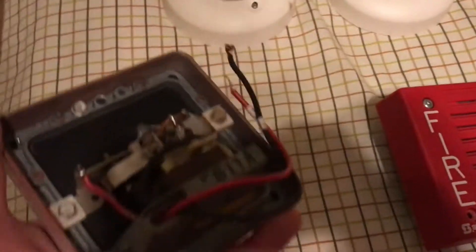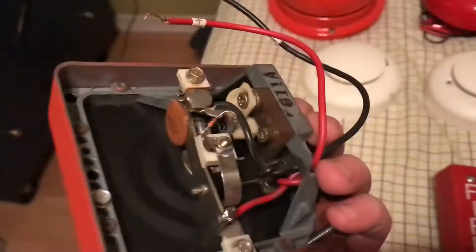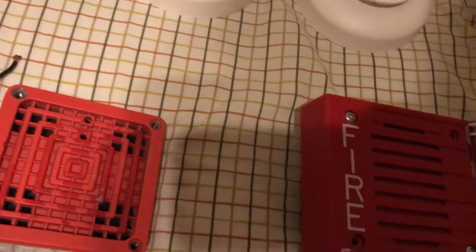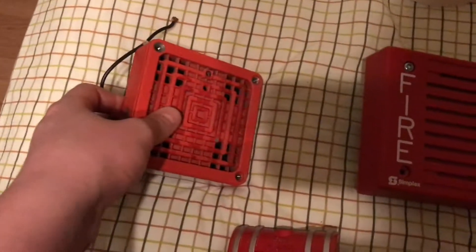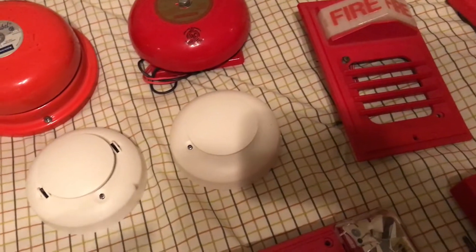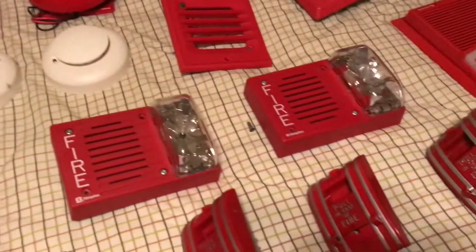Here's the 29198-6 horn. These horns are pretty painful to wire because they do not use screw terminals — they use pigtail wires, which makes it a pain to twist the wires together. You need two wires from the NAC, plus these two wires — that's four — then another two for that, plus a pair to connect them together. Whether it's Class A or B, you still need wires going back to the panel or to the resistor. So you need about eight wires just to wire up one of these.